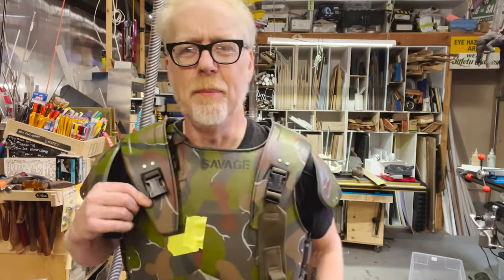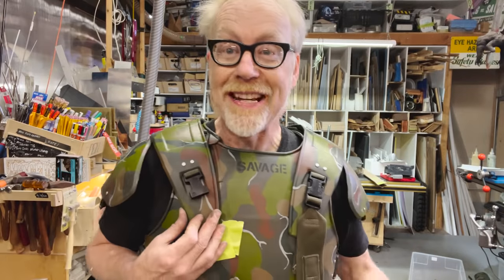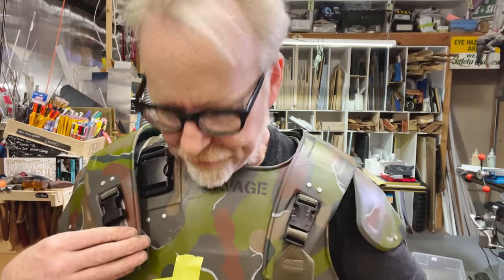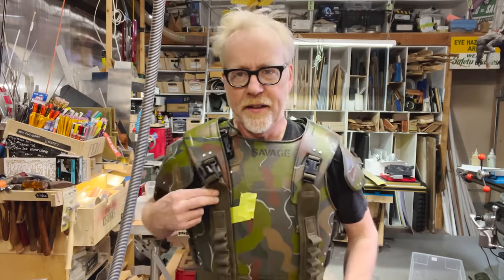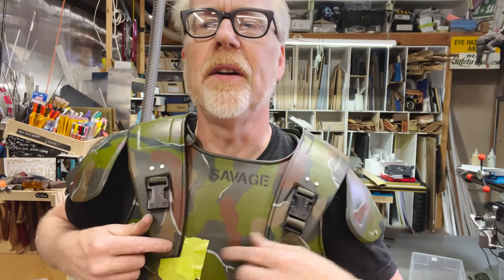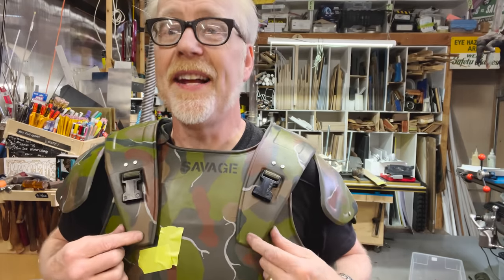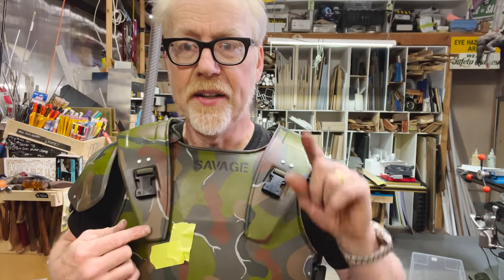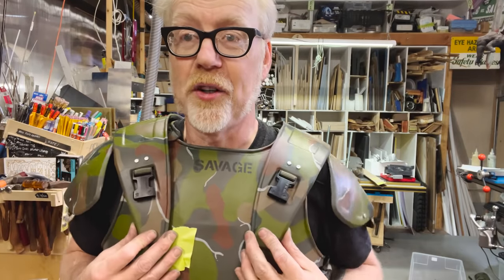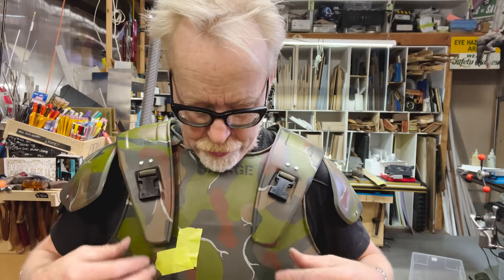This is a journey. I'm not exactly sure. And if you're a Colonial Marine cosplayer, you might be yelling at the screen at this point. I'm just not exactly sure. This thing just wants to fall right off, even when I have this attached to it. So how do I hold it on? I think what I'm going to do is a little attachment, a screw here and the same right here. A little button head screw through a larger hole with a T-nut on the back, 1/4-20. It should be more than enough to just hold it for cosplay, and that'll be the final attachment point before we put these two puppies on, and that should do it.